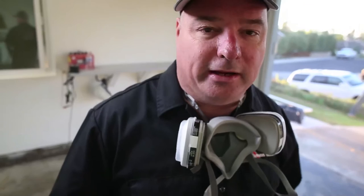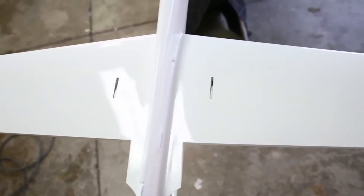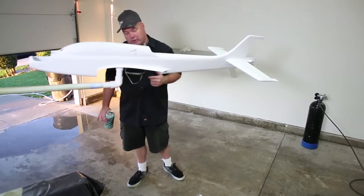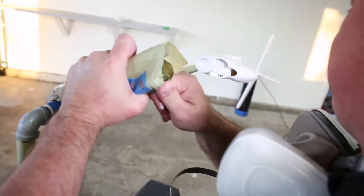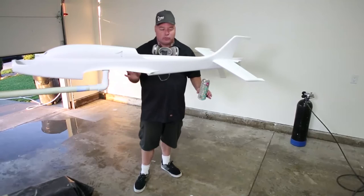It painted really, really easy — the coverage is phenomenal. With the white primer it almost took no paint; the entire fuselage is under an eighth of a pint reduced. I'm interested to see what the scale says when I put it back down. It's 75 degrees and it's lacquer — I went slow on the thinner, and that's really important. Slow down your thinner and don't rush. The paint needs to stay wet at the beginning so that as you get all the way around, the place where you started is still wet, so the paint cross-links and homogenizes together. The slower the thinner, the more time you have to adjust and look for light areas.